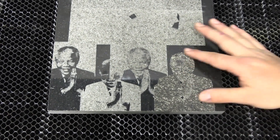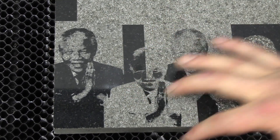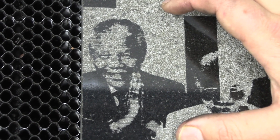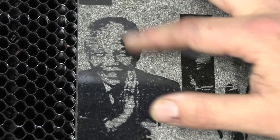This was our first one; this was my second one — this had too much power. I thought maybe power would be a problem, then I went and deleted the background in this particular one and didn't invert it at this stage, and still it didn't give me enough detail. So then we did a third test where I inverted it and started lightening the darker areas and bringing out more detail. Then my final test was this one here — I had my frequency at 50, my pixels per inch at 1000, it was inverted, and I brightened the area around his face, and that left me with my final result.